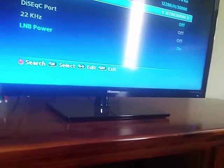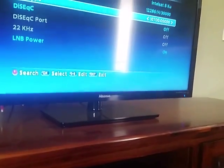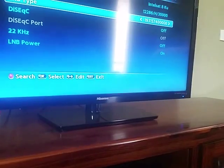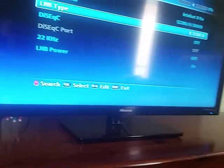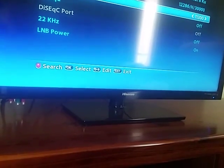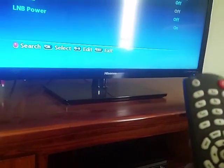Press OK on the remote. The LNB type in this box is set to 10,700, but TV Plus usually recommends 11,300. Press the left arrow button to get to 11,300, then click on search. You can do an update or hit exit and press OK to save — and it's saved.